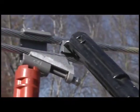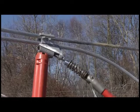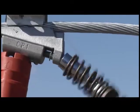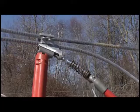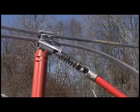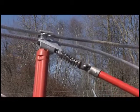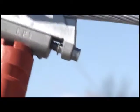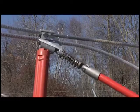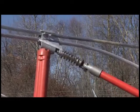There is a stop on the body that will prevent the interface from freely sliding through. Using a universal stick with spring-loaded socket attachment, tighten the bolt until the shear head shears off. Be certain to insert the socket fully covering the bolt head. Make sure the socket is perpendicular to the wedge face. Do not apply lateral force on the bolt head. The top head of the bolt will shear off at approximately 150 inch-pounds or 12 foot-pounds of torque, which results in 3,000 pounds of force in the connection.